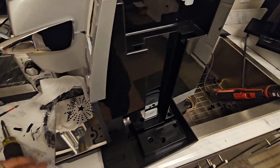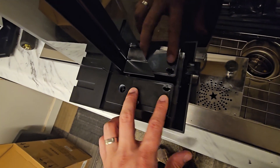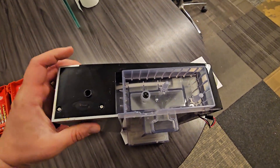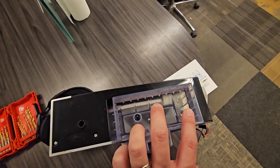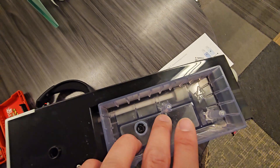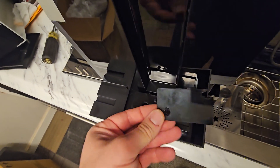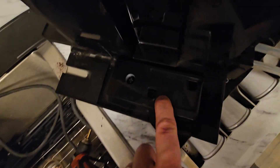And this is where I really made the discovery. One of the biggest differences is that the K150P has two holes in it, and when you get the K155 you'll notice there are no holes there. So I assumed I had to drill these out to make way for the studs on the bottom of the direct plumb kit unit. These studs are what you unscrew from the bottom of the Keurig itself — those two screws go to this. I didn't want to cut these off in case I replace a Keurig again in the future. So I figured I would just drill this out. Once I started drilling, I noticed it's just a plate — flat and not drilled through. Once that plate comes off, you have the same exact notches that you have on the K150P. Super simple.